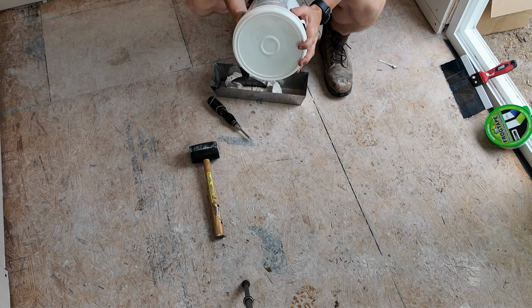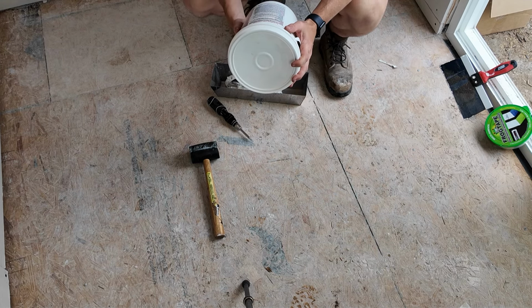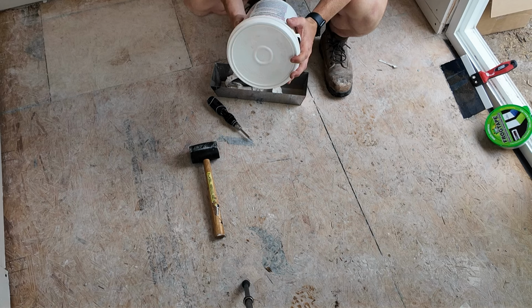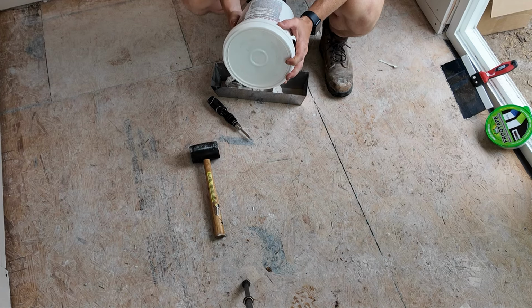Just for a quick descriptor, this is all-purpose joint compound. It can be used for all coats in the reinforcing and concealing of joints. In wallboard construction, it can be used for taping, finishing, fastener concealment, filling corner bead, and texturing. Doesn't say anything about working time.